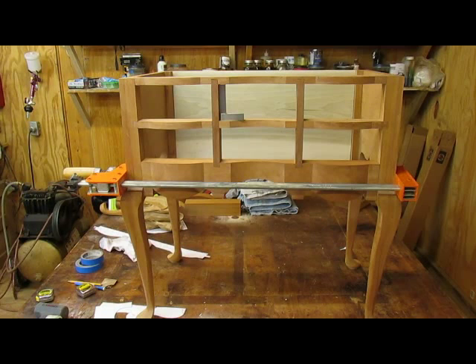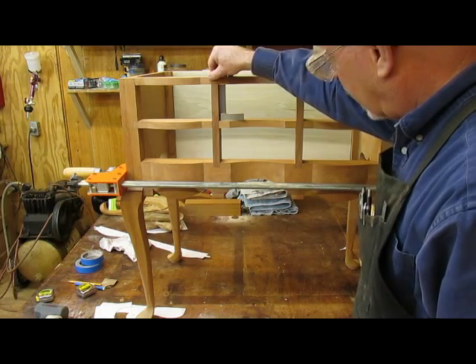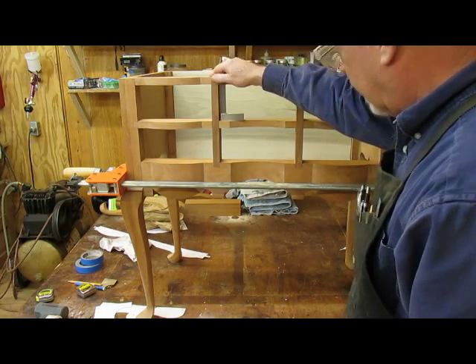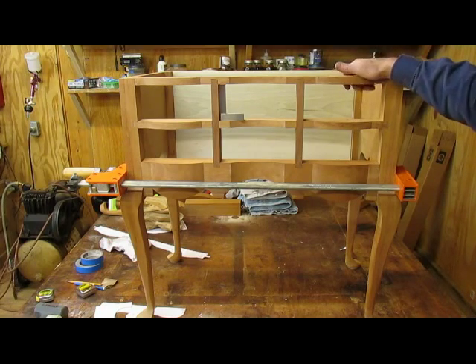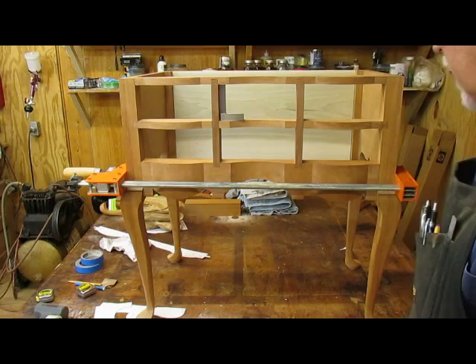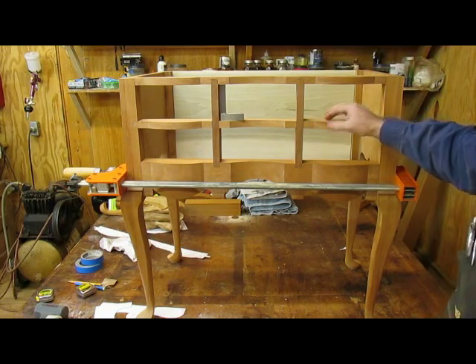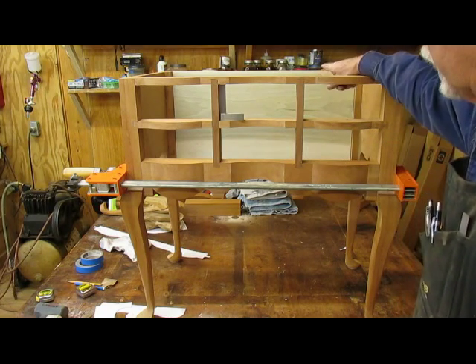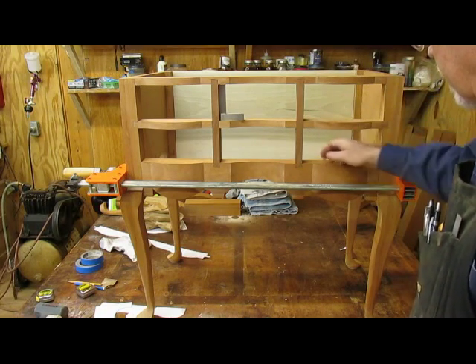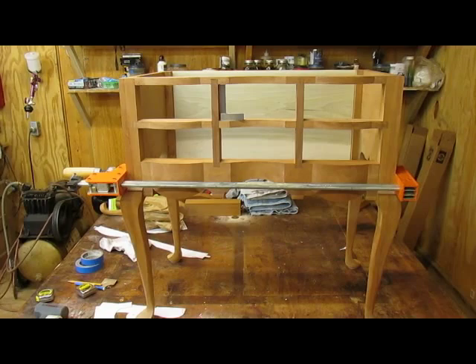The vertical drawer dividers are in and we're happy with the dovetails — three out of four are nice. This one here chipped out a bit, but the lid will cover that, and there's always wood filler. They're nice and straight and reasonably matched. Now the drawer runners have to be put in — I'll mortise some to the back, and on the front I think I'll put a rail on the inside so I can assemble it.